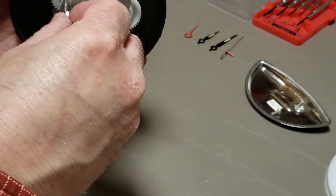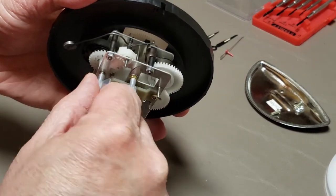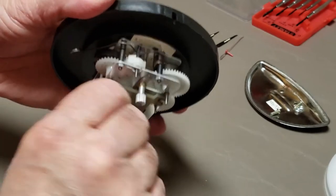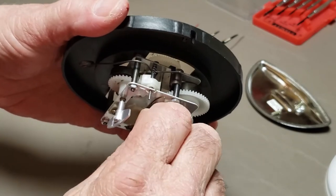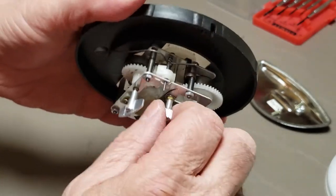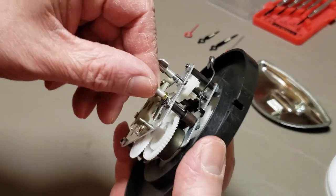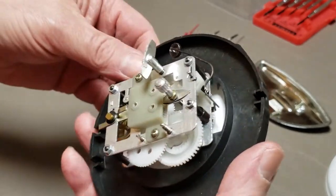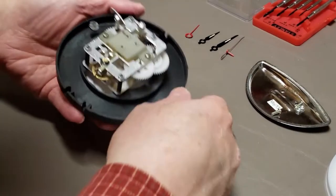Okay. And when I wind the alarm, the clip is supposed to pop out. There. See how the escapement moved up? So I can wind the alarm, and then I can turn the alarm time. Notice this is pulled out, and so this pin is free of that arm. It's kind of upside down, isn't it? You can't see it in the light. There. Okay, now as I turn there. And it either runs down or you can push the button to shut it off. Okay. Great. I can put all this back.